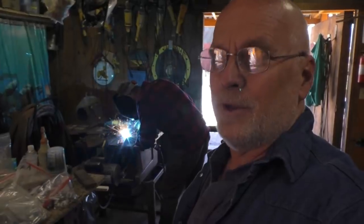One of the hardest things to do is get your welder set up when you start welding. A lot of people put up wire speeds and amperage on videos — don't pay too much attention to that. There's also a chart inside your welder; don't pay too much attention to that either. Just get in the ballpark and then play with it. Try more heat, less heat, more wire speed, less wire speed — you've got time. You'll get to know what your machine does, and that's the best approach.